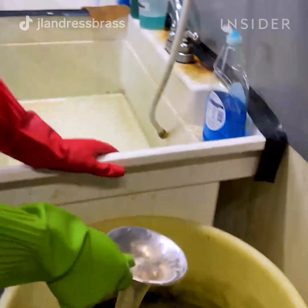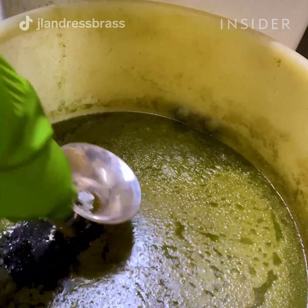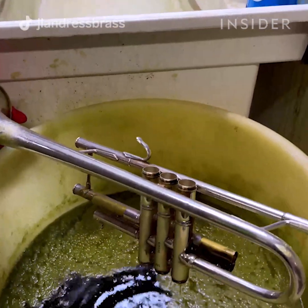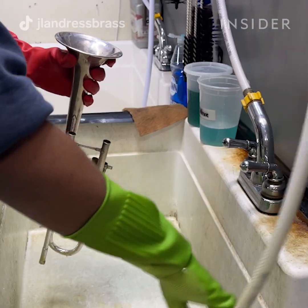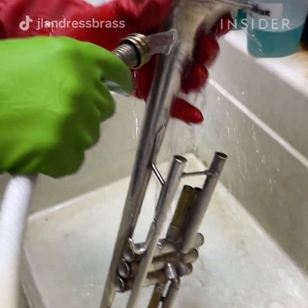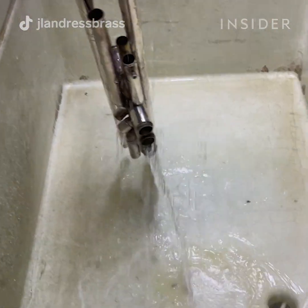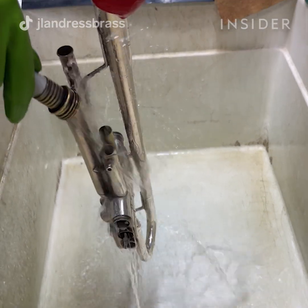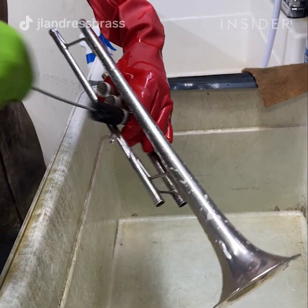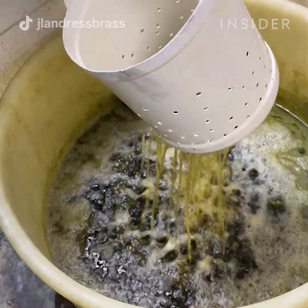One of the first steps, especially for a silver plated instrument, is to degrease it. We have this sludge — it's actually the only kind of toxic chemical we use in the shop, which is an industrial paint remover based out of methylene chloride. Really nasty stuff, but we use that for removing lacquer, which is a clear finish over an instrument, and we also use it for degreasing. We want to remove all the biofilms, oxidations, corrosions, and build-up of gunk that's been in an instrument for many years.